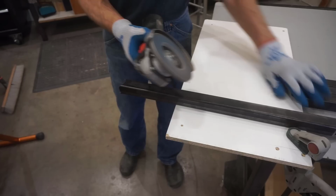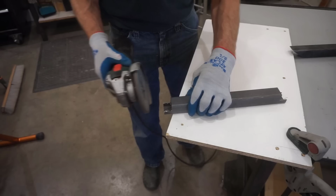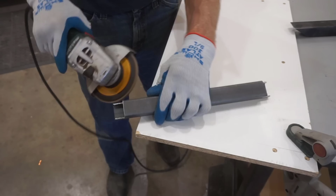Once I've finished making round notches on the bottom of each of the four legs, I spend a few minutes with an 80 grit flap disc in an angle grinder to clean up sharp burrs on the round notches as well as end cuts on the rest of the pieces that I've made so far. This quick and simple step makes the pieces safer to handle and allows me to get a better fit and finish in the following steps as the build continues.